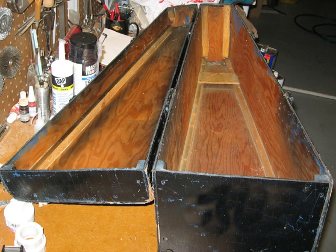The floppiness of the wood on this case means that the latches and hinges don't always work right, so the hinges may bind, the latches don't always line up correctly. They're easily sprung from various flexures of the wood, and the case itself, while strong enough to protect the instrument against bumps and bangs being carried around, has very little other structural integrity, and if somebody were to, for example, sit on it or stand on it for some reason, you'd probably go right through it. The quarter-inch wood isn't really strong enough to support the weight of a person, for example. And while I don't consider that an important requirement, a case should be able to withstand accidental abuse much more severe than normal carrying around.